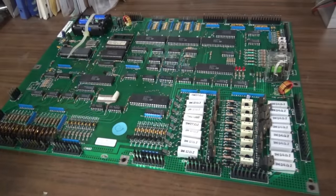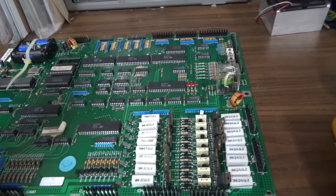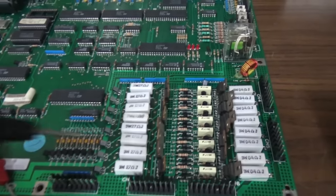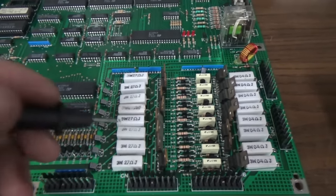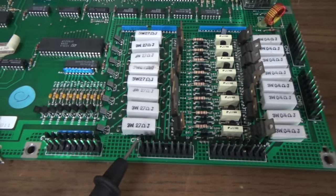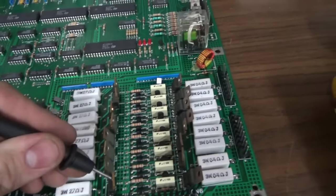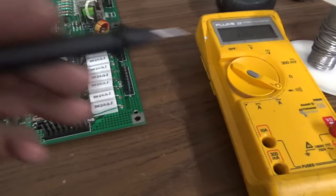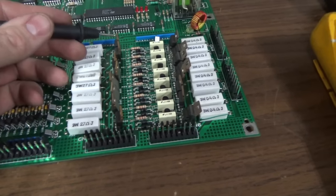Before I do that, I'm going to check switches in case we have a switch problem, so I might as well fix it while the board's out. Here is the MPU. Switch matrix problems are pretty easy to test because you've got eight that do the same thing — you're seeing if one is different from the others. These plug in right here, and this is the one that's screwed up: the top transistor. I have the positive lead on ground, on diode test, and I'm checking the center leg of all these transistors. They all measure the same, including that top one. Now I'll check the top leg.